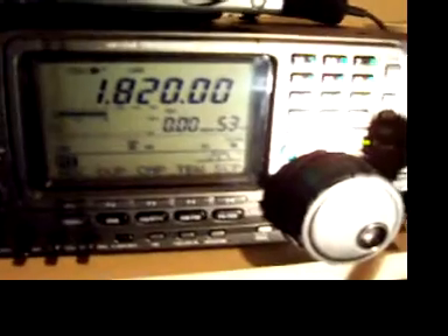I apologize for the backlight not working on the Icom here — the 7400. The backlight circuitry, I believe the transistors are gone, and it's hard to get that fixed, so I'm just using a torch to shine up the screen so the camera can pick it up for the recording. I'm hoping to get that fixed shortly. It's a bit of a problem with some of the 746 Pros and the 7400s — I became a victim of the backlight going about four months ago.